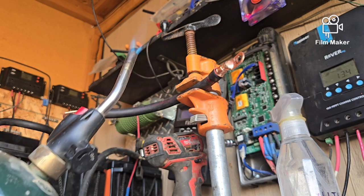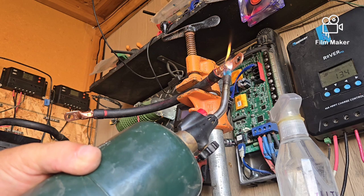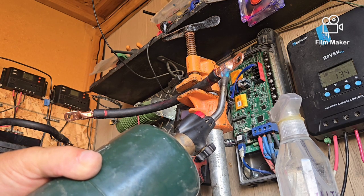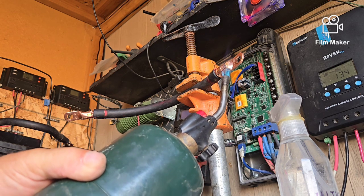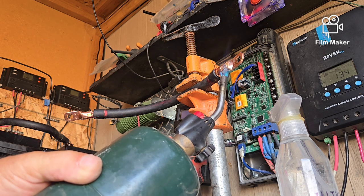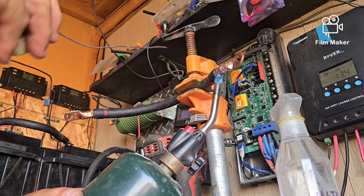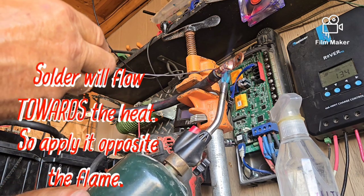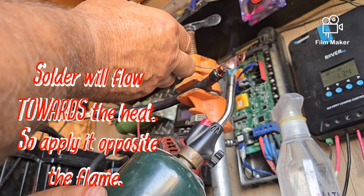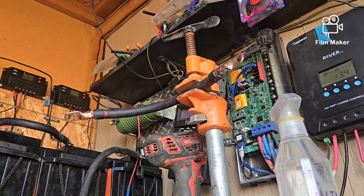I'm going to take my solder and extend about a six-inch length off of it, and just start heating up this lug at the end. Always start heating from the bottom, because as we know in thermodynamics, heat rises — so if you're heating from the top you're defeating your purpose. If we heat from the bottom it'll go up automatically. Then you take your solder and just put it right in here, and you can see it's melting right in, getting shorter, and it'll just keep going in until there's enough in there to solder it. That's it.